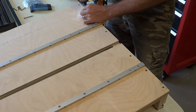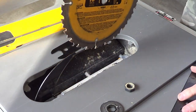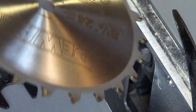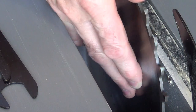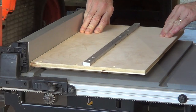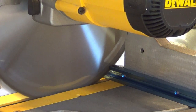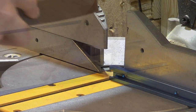So next I'm going to take the front and back fences off so I can cut a dado on here. I did get some glue in there so this might not come off easy — not bad. I'm just stacking up my dado blade here to get it to the thickness of the rail I'm trying to put in. That's pretty close — might be too tight, I'll try it. Put the writing to the outside. The blade's facing the right way.